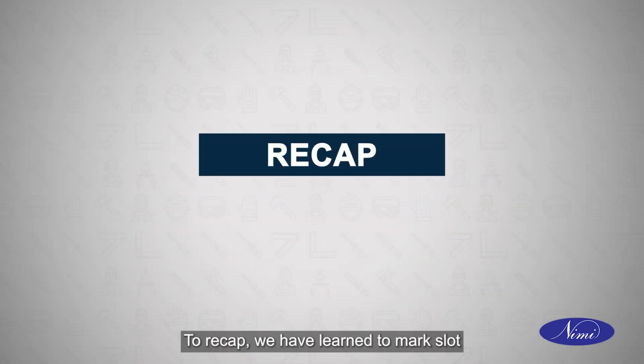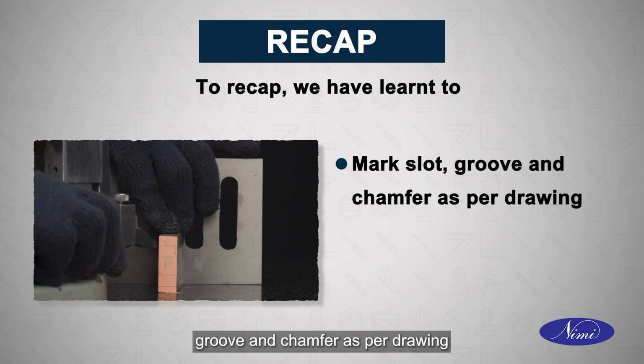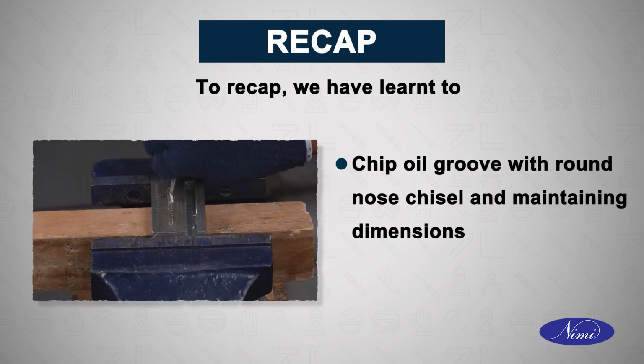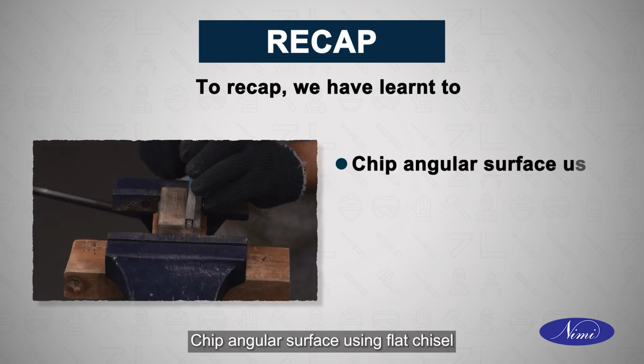To recap, we have learned to mark slot, groove and chamfer as per drawing. Chip slot with cross-cut chisel by maintaining the dimensions. Chip oil groove with round nose chisel and maintaining dimensions. Chip angular surface using flat chisel.